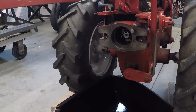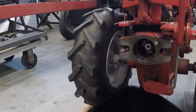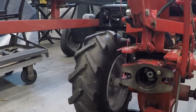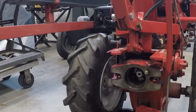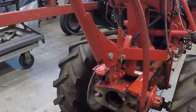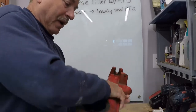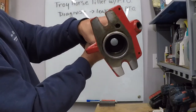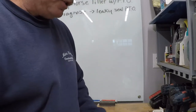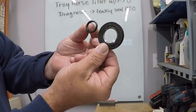As you can see, we've got the tiller split apart and the PTO drive is taken off. You can still see it's a little wet in there where the spider coupling is — that was from a leaky seal on the PTO side. Oil leaked from the PTO into the transmission side of the tiller. It was pretty wet. Since I've cleaned and degreased it and replaced that seal, the seal itself had separated into two pieces, so I knew right off the bat that was the problem.